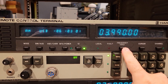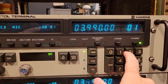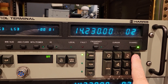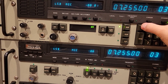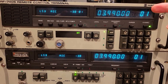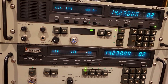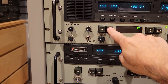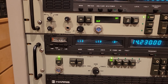Now you can do everything you would normally do — you can change the frequency or change the channel. Let's go to channel two. There's just a little delay. Channel three. You can see all of this — channel O1, enter. The bottom one is commanded and then it's read back into the remote unit. Now let's operate — we could also enable the clipping. You see the clip goes on and off here; clipping is indicated with a little indicator as opposed to an LED. Some of these design decisions are interesting but not bad.